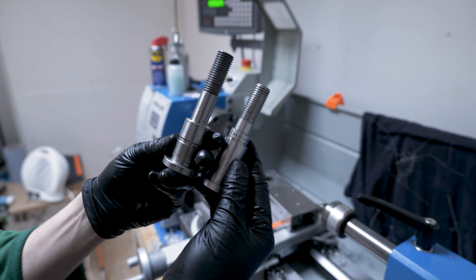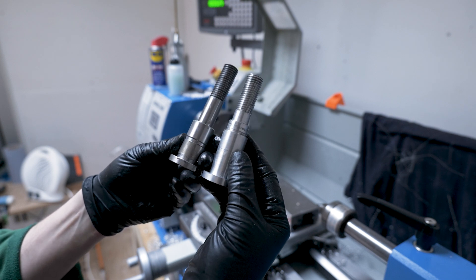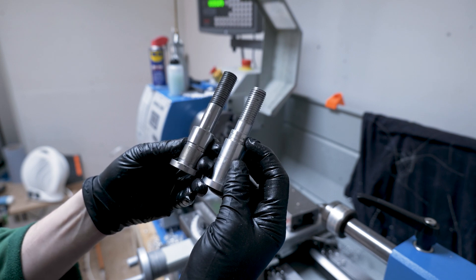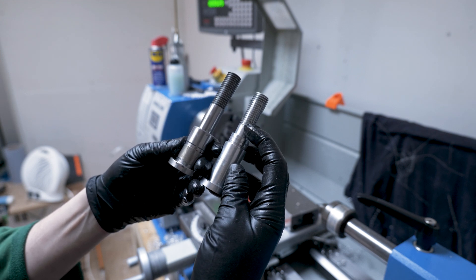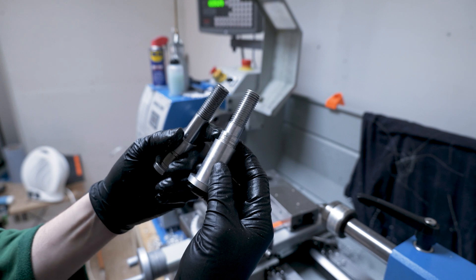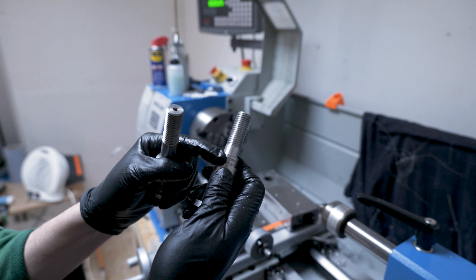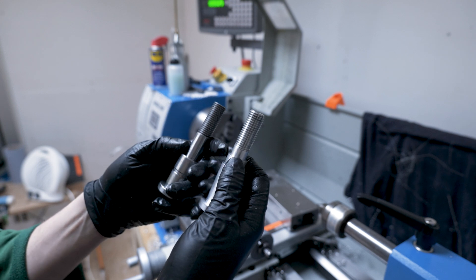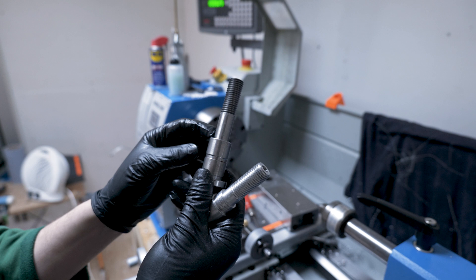So it's the moment of truth. You can see I've been able to make it kind of similar, but this shoulder here — which the Multifix is going to sit on — should have actually been much taller. There's not too much registration here. I had to use this part to clamp it into the four-jaw chuck when I swapped it around, so it's not the best registration, but I'm hoping this will be enough to just keep the Multifix in place while I machine this down.